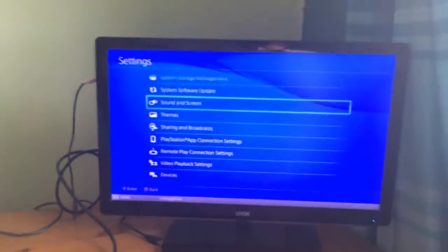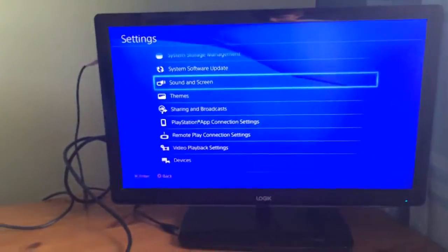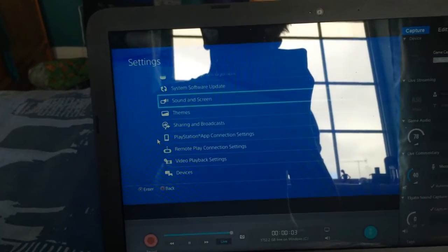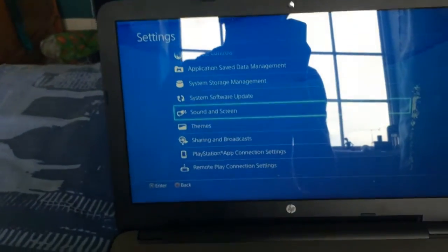Once the app is open your TV screen will go black, but that's just because the signal is being redirected through the capture card — it will go back to normal. You can see the footage moving around in the app. There is obviously going to be a little bit of delay lag, but that's nothing to do with your Elgato — it's just because the signal has to go through the wire, through the Elgato, and back out. That's the only reason there will be some delay.